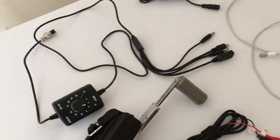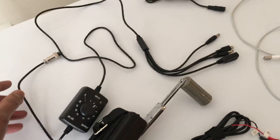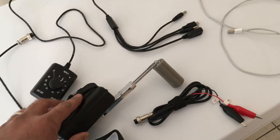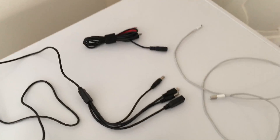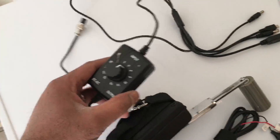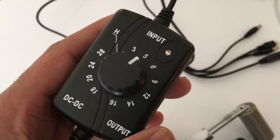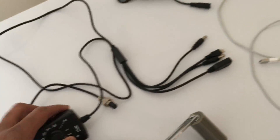Let's say I'm stuck somewhere for over a week, or maybe four or five days, and the capacitor bank dies because the battery can't keep the capacitors charged. What happens is this thing comes with a DC-to-DC converter, and you can see the voltage goes all the way up to around 28 volts, and it can kick out close to around two amps.